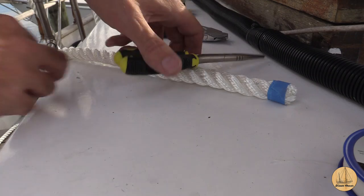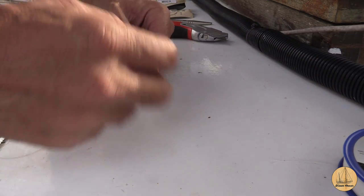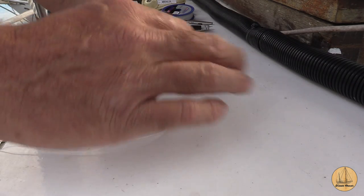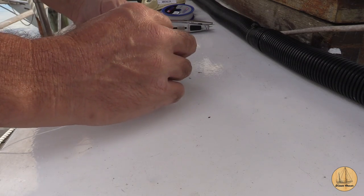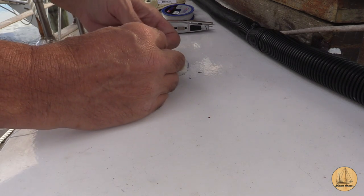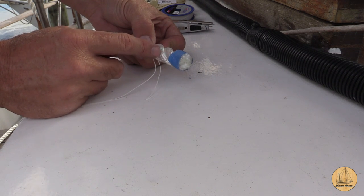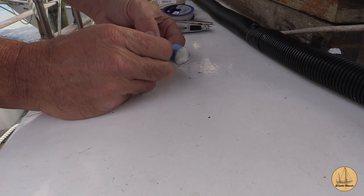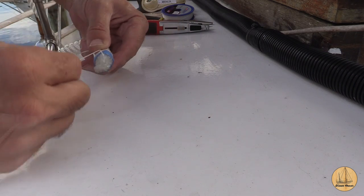I just went ahead and cut off a length of this. It's important to get enough so that when I finish my whipping, the number of turns around it should be the same thickness as that. You want to start with the bitter end of the whipping twine right at the edge of the bitter end of the line, go up about four inches, form a loop, and leave the long end hanging out. I'm going to start my whipping right about at the tape, going to about the same diameter, and I've got a pretty good sized loop. I'll hold that there and start my wraps.